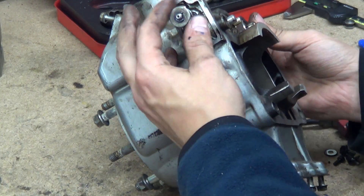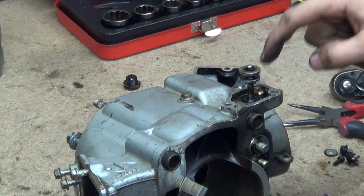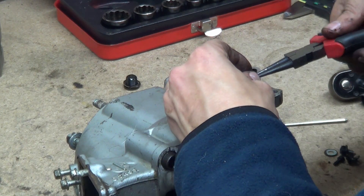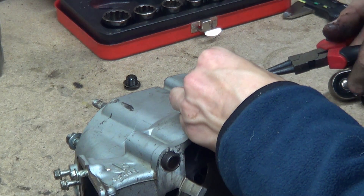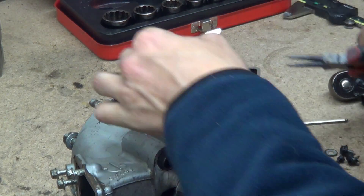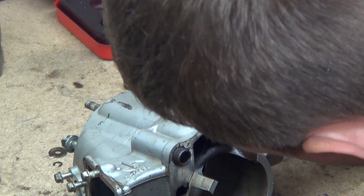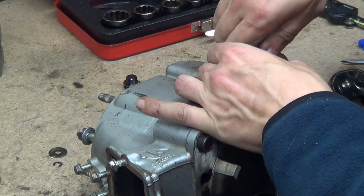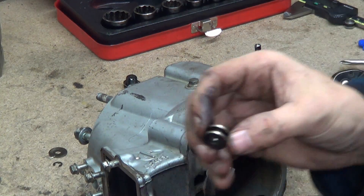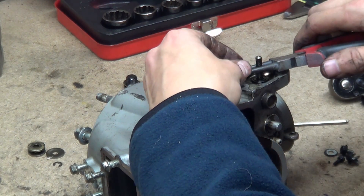The main rod is a bit of a pain. What we need to do is take this E-clip so we can push this rod through. There's a seal bearing on here with a nut. First thing I want to do is get this E-clip off. There's the E-clip — it's come off the end, which means this washer and the actual guide itself should just pop off, but it's got a burr. There we go, so that's the guide off. There's another annoying E-clip to stop it going all the way through.